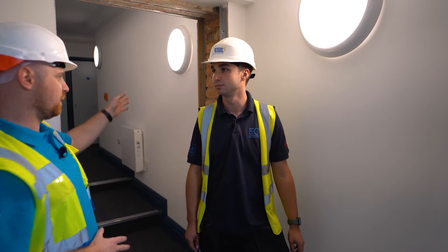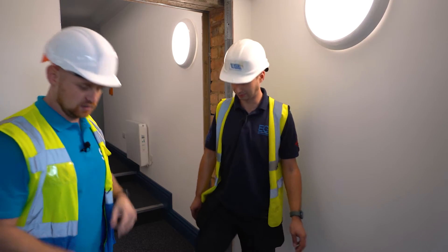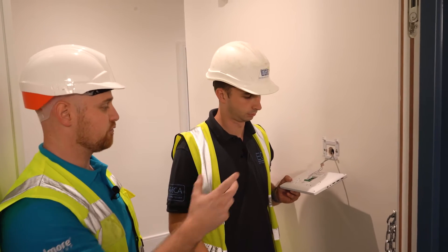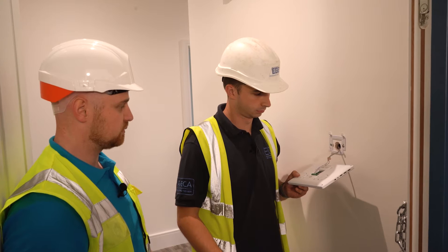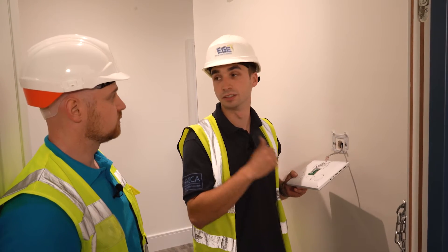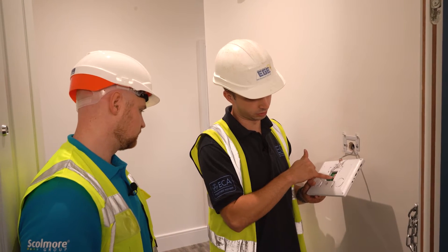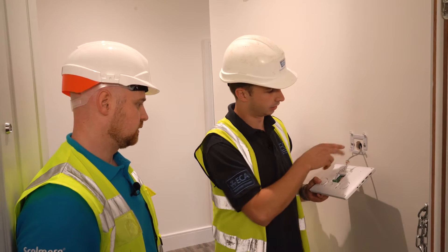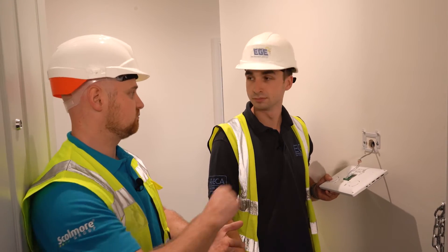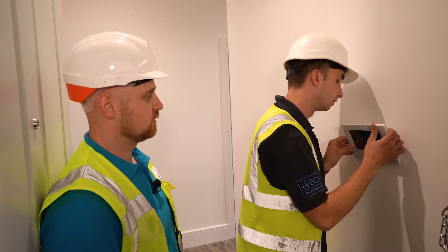You've got these hooked up to six apartments, so can we take a look at one of them where you've got the monitor so we can see what the occupants would be seeing? We're inside one of the properties now where we've got the monitor linked up to the door access out front, and Fred's just finishing off the install. It's the e-bus system — in and out, it goes over to the communal cupboard which alerts this flat. We've got the dip switches set between one and seven, so this is flat six and we've selected dip switch six. It's literally two screws, a bracket, and clip on. That's quite a clever function — whichever flat you're in you hit the switch, so you're not getting alerts going to multiple apartments.